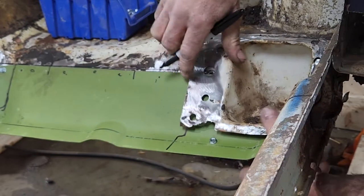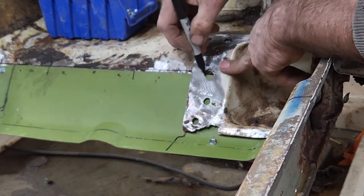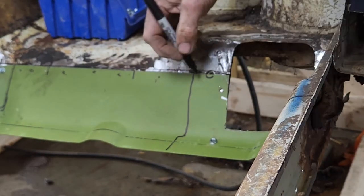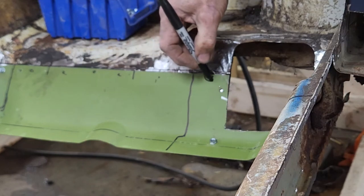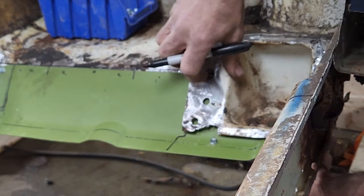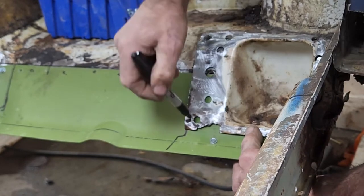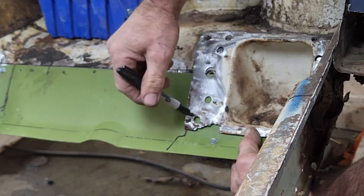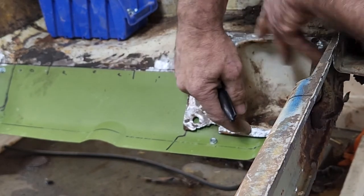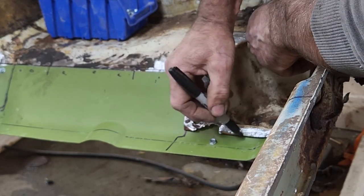Here's, I don't know if you can see it or not, the seat belt hole for the bolts right there. So I just pretty much got to clean this up with probably a die grinder, make that hole round. That piece fits right in there. And all you do, the spot welds are already cut, drilled, is just drill them in all the way around. These weren't even spot weld. I think these were just MIG welded in here.